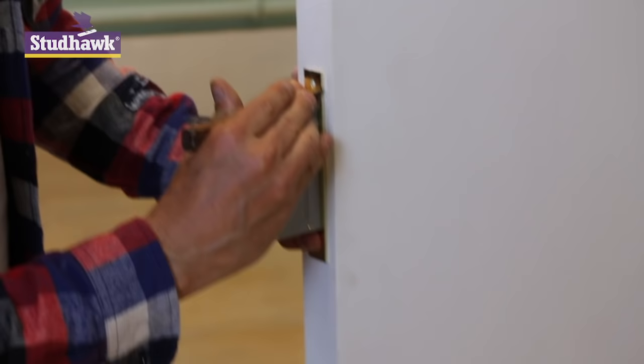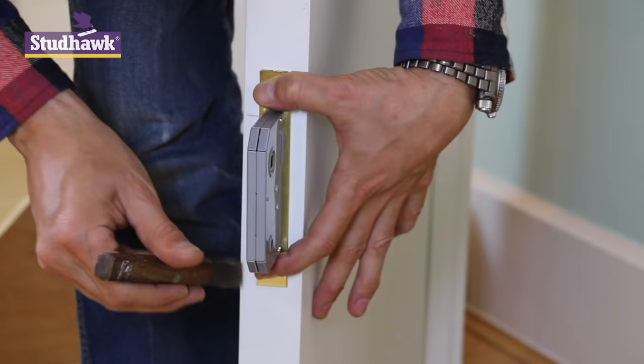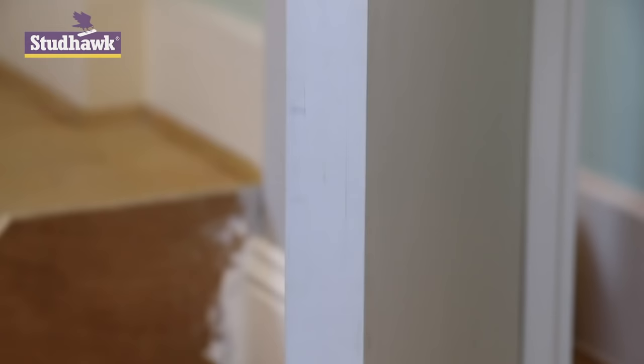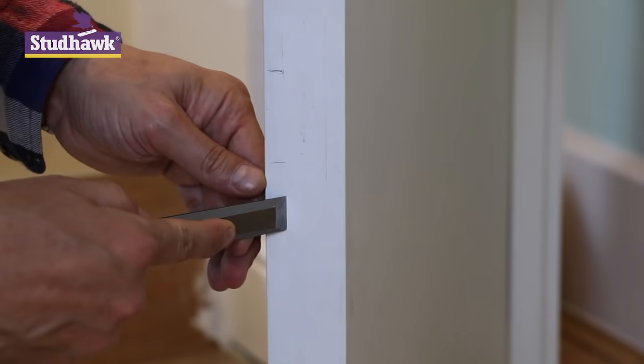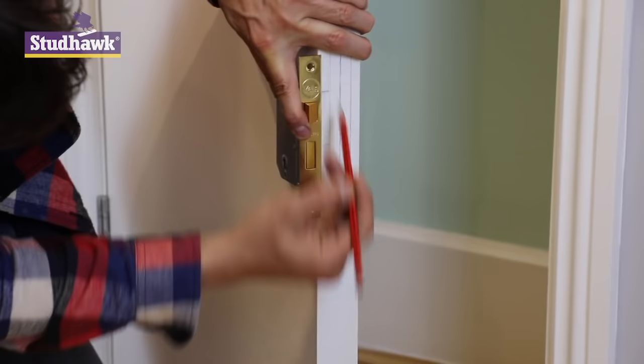So we've got a square, and I'll put in our knife mark and then scratch that there. The reason why carpenters like these — either a striking knife or a marking knife — is because you've got a tiny little scratch there and it helps locate the chisel. Once we've done our knife marks for our lock, our faint knife marks, we line up the top of the plate to the top line, bottom.